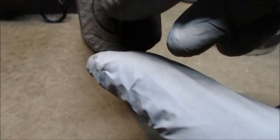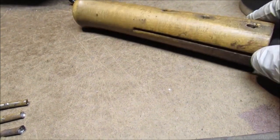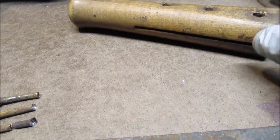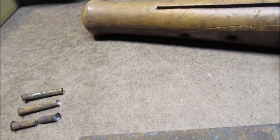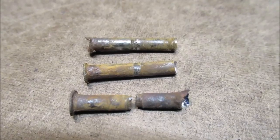This only goes on one way. Looking at the end, I can see where it was made in the lathe - there's like a center hole. We're going to fill the crack full of super glue and let it cure before we sand it. Sometimes we'll get a thin knife blade or razor blade and spread the wood apart so the glue flows in quicker. Super glue goes in faster and dries better than wood glue. I'll take a picture of these rivets just for the fun of it, so stay tuned for more.